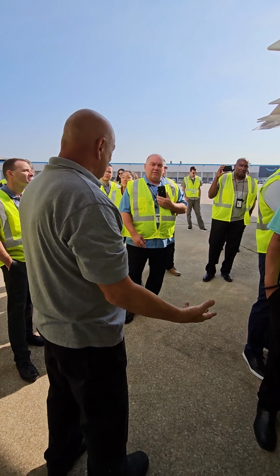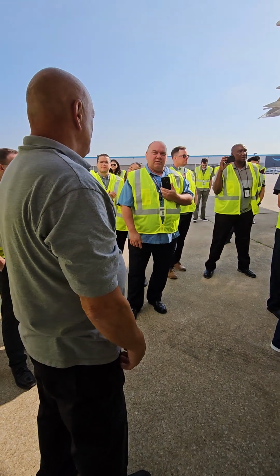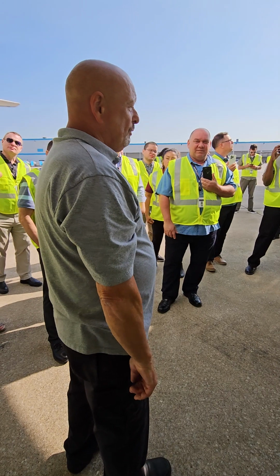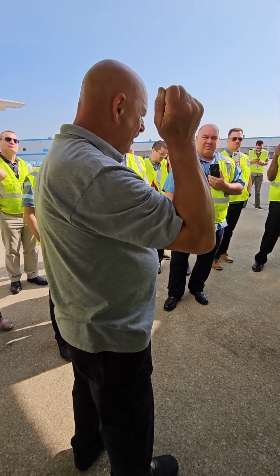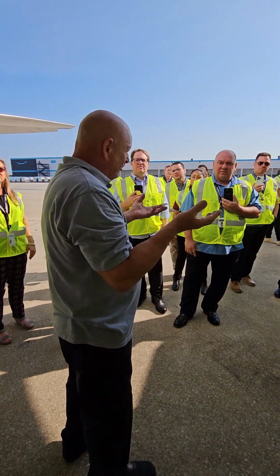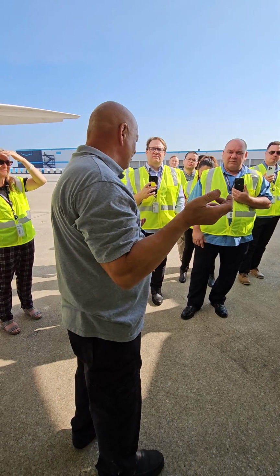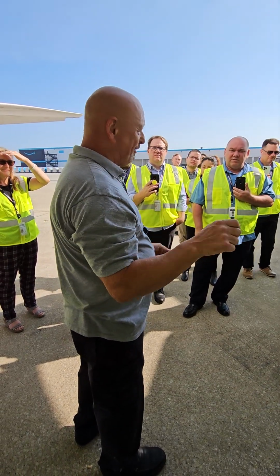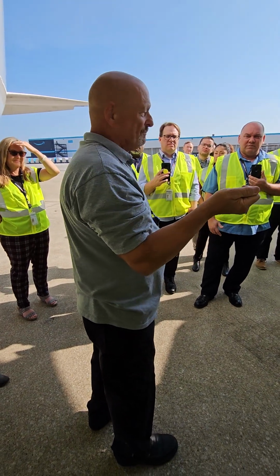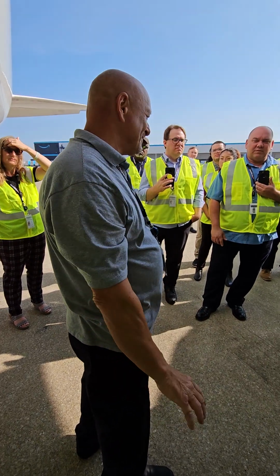Half speed. What about if it's in the second segment? You comply with the... pretty iffy. All right? So if you went positive rate, gear up, and then I got a bunch of hydraulic lights because I had such a load on the system, me, because I was an engineer for 28 years, I would go to the ADP and I would go to on instead of auto. So maybe it just failed to come on automatically. But it's not a memory item, right? Maybe it should be, but it's not.